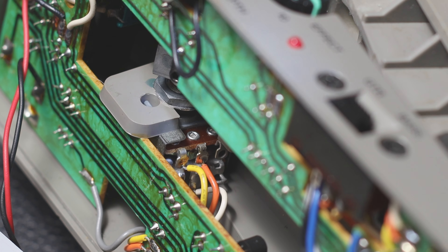This is B-Roll Marcos talking — I messed up. There are in fact dual potentiometers in both the gray and black version of the WH-10. You can clearly see a yellow and orange wire occupying the top lugs of the potentiometer that is controlling the boost. We're going to open up the black version so you can also see that there is a dual potentiometer. There is some merit to my claim because those lugs are not being occupied by any wires, which means it is out of the circuit — that's why I get different tones out of this pedal compared to the gray version. Just know that when I'm talking about this pedal not having a dual pot, it does — it's just not in the circuit.